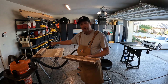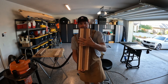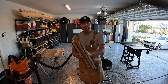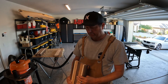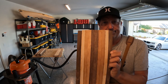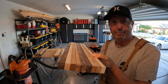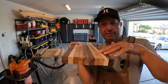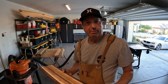We've got all of our boards glued up — six of them, each one looking a little different but the same size. What we're going to do now is surface both sides so it's nice and smooth, and then we'll cut them down to size. You can kind of see the glue-up on the sides there — there's a lot to clean up on both sides. It's not really even, even though we tried our best. So we're going to surface this down and get it all planed off and the surface smooth on both sides.